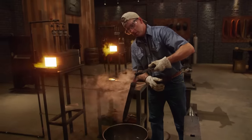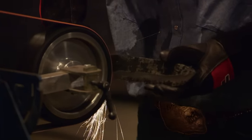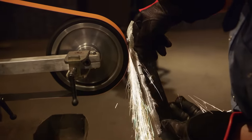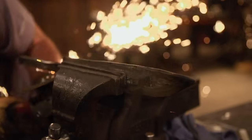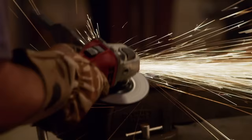Steve just quenched his blade over here. Pretty straight. Ain't bad. I've got time to get to the grinder and get some of that mild steel off from the can to where I'm down to the hard steel. Running out of time, I've got to grind down through the mild steel to get to the hardening steel. I'm going to get a good solid quench.